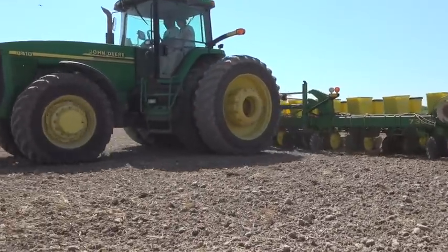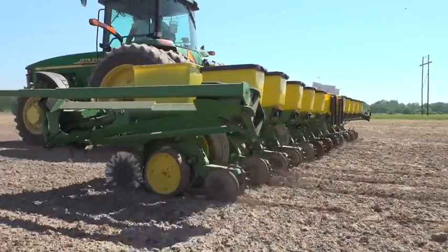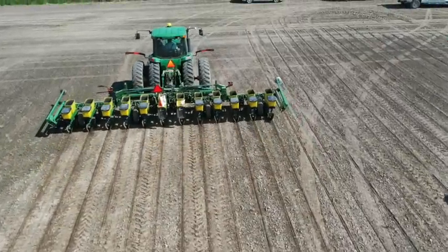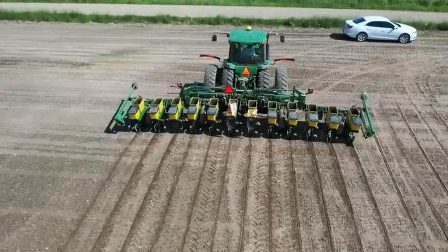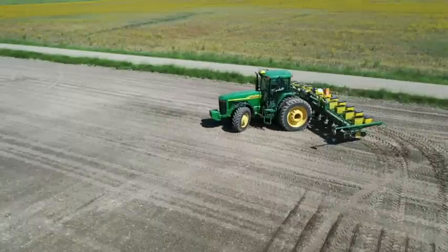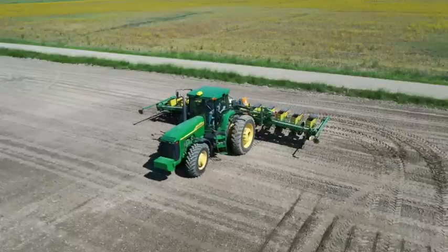While a lot of the crop is planted no-till, since this field had had tile installed last fall, we had to do some cleanup and leveling. It had received some rain on it since the last tillage, so that makes it easy to see the rows made by the planter. As he lifts the planter, you might notice that the ends sag a little bit — that allows the planter to maintain good soil contact when it's not quite level. Those wings can float up or down as necessary.